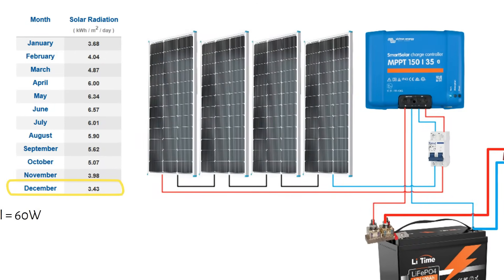Now that the solar panels are sized, let's size the cable that will carry the power from the solar panels to the charge controller. I have calculated the wire thickness from the solar panels to the charge controller — they need to be 12 gauge, so I will include that in the parts list. We also need a disconnect switch to isolate the solar panels from the system. We can install a 10 amp DC circuit breaker right before the charge controller's input.